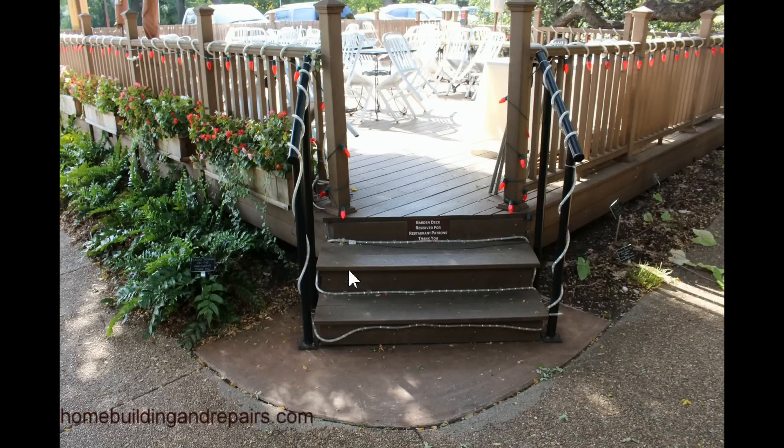Then of course you could put your lighting underneath the nosing. But if you don't have a nosing, maybe put it in the middle — just don't have it on the ground. The last observation I'd like to point out is that this is considered a grippable handrail. On stairs with more than one step, I believe you need to have a grippable handrail, and this lighting right here is going to create a problem for that in some cases.